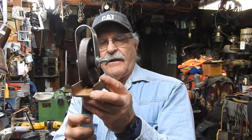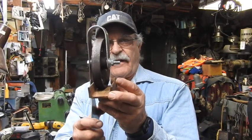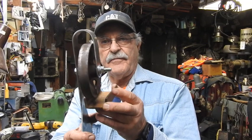Of course, the length of these bolts will be adjusted, but the door should hang directly underneath it here where my finger is, and that should just run right straight up the wall. And of course, we have to have a little standoff bracket down at the bottom to hold the doors, with a little horizontal roller to hold against the doors as they roll down the track.